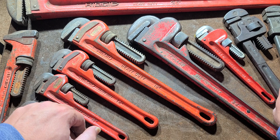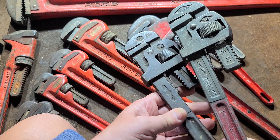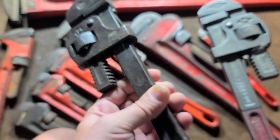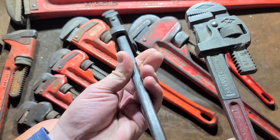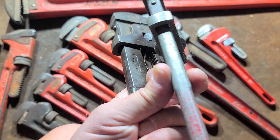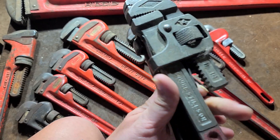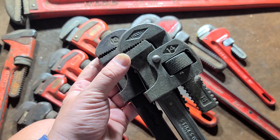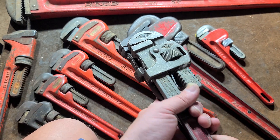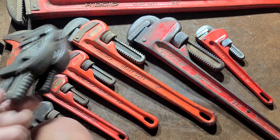I have a couple of other Stilson's — a much older one and a newer one. You know the older ones because they just have this kind of logo on them. This one's really nicely finished, but you can see the thick forging line, and the same thing here — the really wide forging flashing — because the jaws were forged as one piece, part of the handle. So a lot of people just started thinking all pipe wrenches are forged.